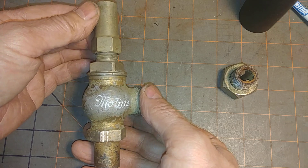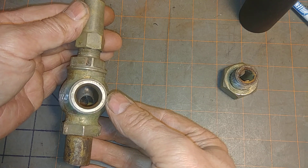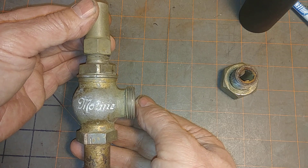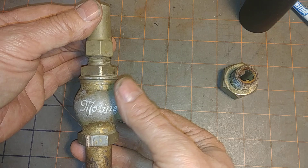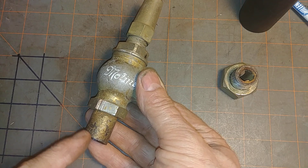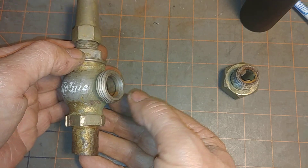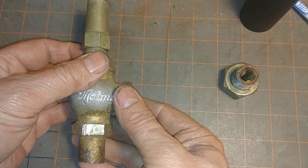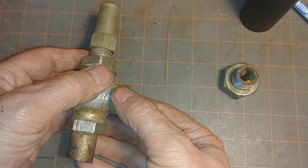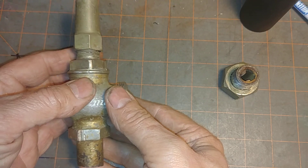Now why would you want to shut this off? Well, if you remember, this was back in the days of the coal era. And if you needed to isolate the radiator from the system, not only would you need to shut off the inlet, but you would need to shut off the outlet so you could completely isolate it, because there would be the possibility of steam coming up through this valve. Normally this would be either a trap or a return L or some sort of method — and this was Moline's answer.